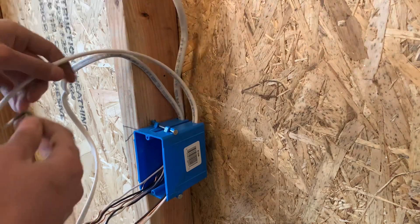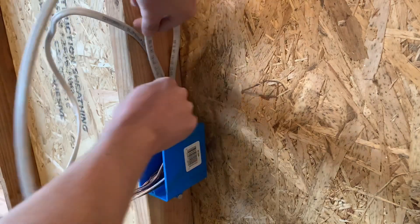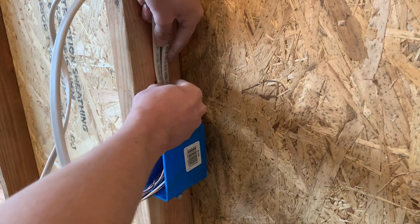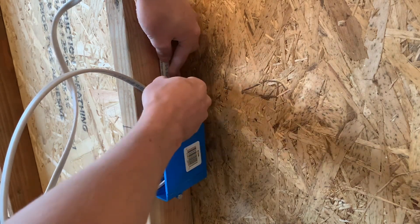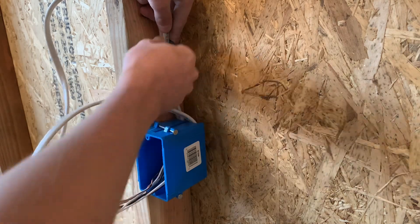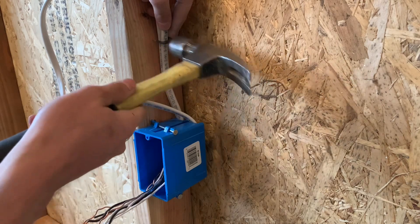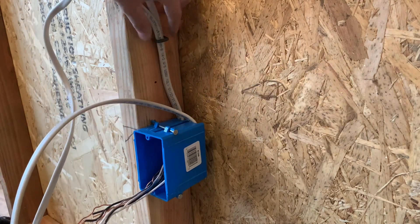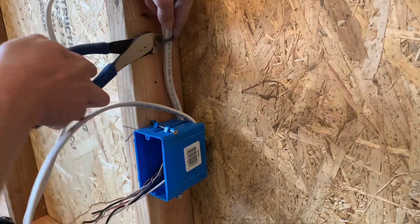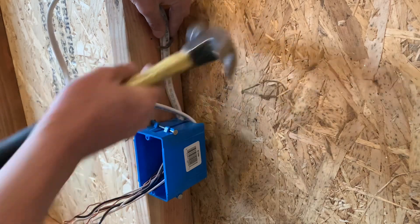You're going to want to start off by putting two of these in the center. You're just going to want to put these side by side — stack two on one side and then one on the other side, sort of like this. Get both of these as close to center as possible. You're going to want to go up about six inches, and usually you can do that by sticking your hammer up there. Six inches is the ideal, but you can go lower — you definitely don't want to go too much higher. You can take your staples and angle them to get them a little bit tighter, because if you put the staple sideways it's going to give them more distance apart, putting them closer to the edge, and you don't really want that. So kind of tilt them at an angle — it'll give you a little bit tighter space.